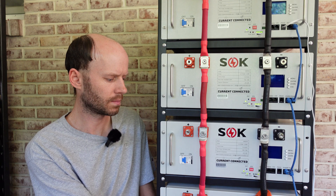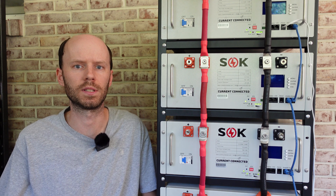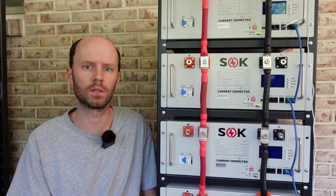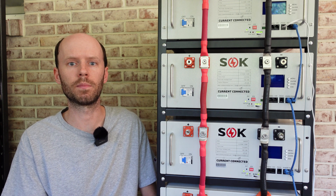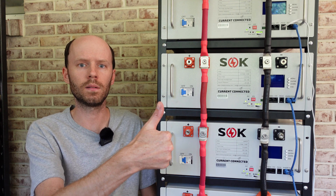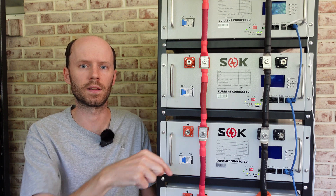That was a very cool demonstration and a very cool test. About 10 amps are still flowing so the batteries are still equalizing, but the amount of current has dropped by about half of what we saw originally. Again, I still recommend having these batteries at the same voltage prior to paralleling them together — I think that's best from a safety perspective. However, I do like seeing that some of these companies have taken into consideration that people may not always connect them in the best or most preferred way. It is a great safety feature to have included. Hit that like button before you go, any questions or comments you can leave those, and thanks for watching.